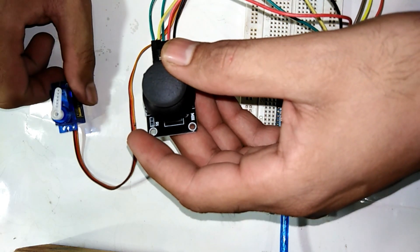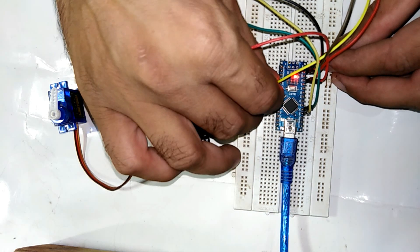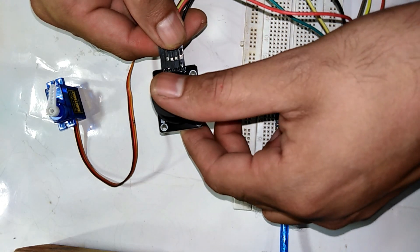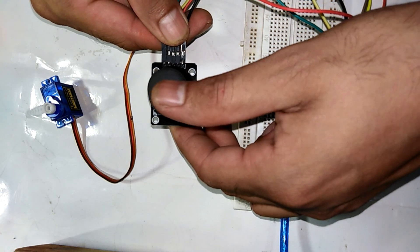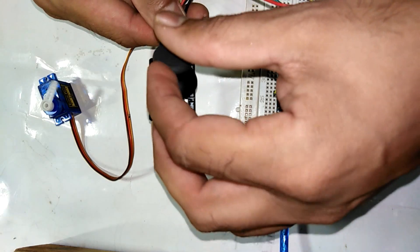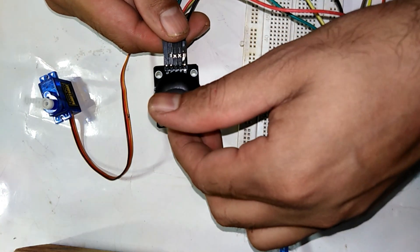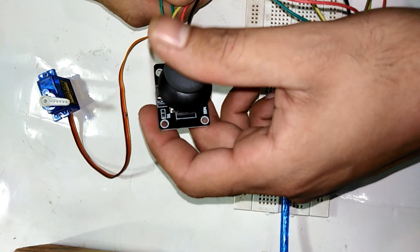It's working perfectly. If I change from D3 to D5 I can now use the second axis for up and down motion. So you can control two servos with one joystick. If you want to control four servos you need two joysticks and four servos — just add more servo and joystick values and you are good to go.